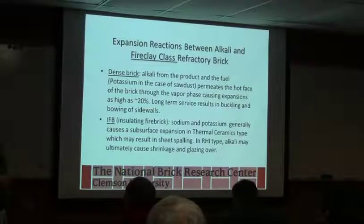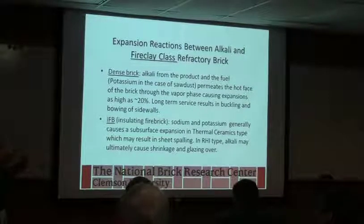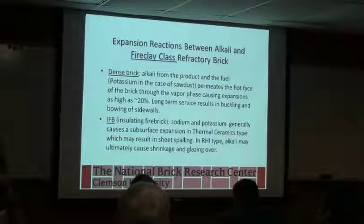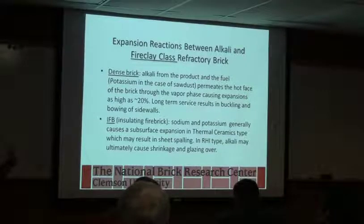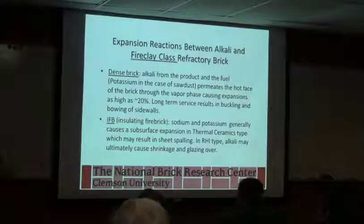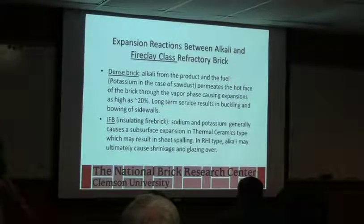So it takes a lot of thinking and discussions and calculations to figure out how we actually get this to give us the best chance that everything's going to knit together. At the same time, you also have to think long term. Whatever you're firing in it can also impact how this stuff's going to perform. When you start getting these materials depositing, you're also changing the R factor of your wall too, because you're changing the chemistry of it.